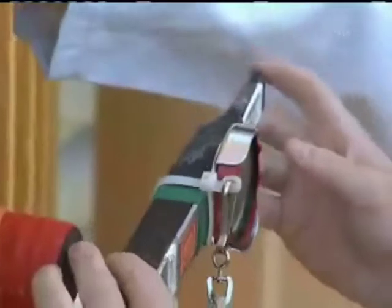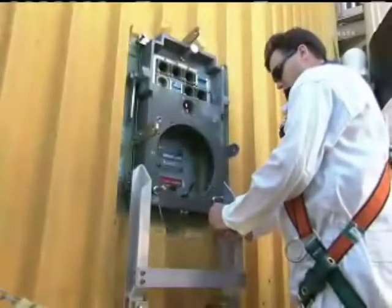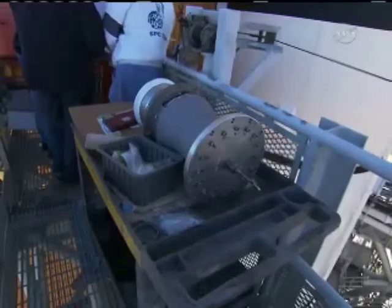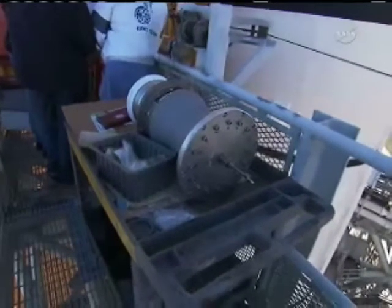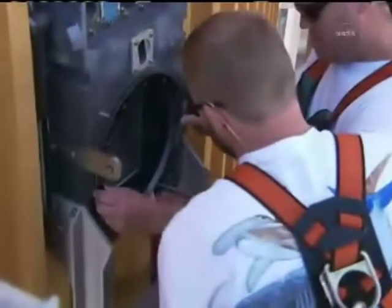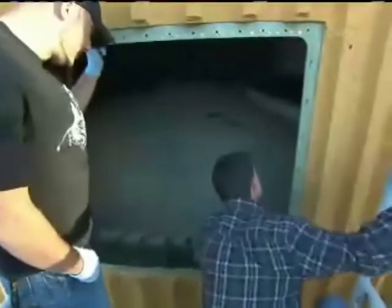And once we got that carrier plate reset, the new power bolt installed and everything set up the way we wanted it, we began a series of measurements called concentricity measurements to verify that the opening in the plate indeed was as aligned as possible with the opening in the actual external tank. Throughout that process, though, we came to learn we were not controlling a variable that was very important, and that was the concentricity of the actual QD itself.